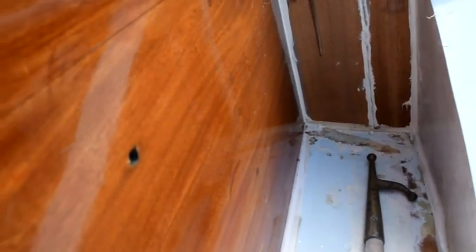The other small leak I have is right along the base of the cabin house, and the caulking there right up forward appears to be cracked. So I'm going to put some tape down on the edge of the deck and also on the bottom of the cabin house there. We will then put down some caulk along the base of the cabin house running aft for about eight or nine inches to hopefully seal that up, and that should close everything up.